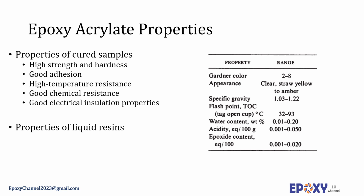In terms of shrinkage, upon cure, the volumetric shrinkage of vinyl ester resin is generally lower than that of unsaturated polyester resins, but higher than that of their parent epoxy resins. The volumetric shrinkage increases with increased backbone, double bond, and co-reactant content. Because of their high shrinkage values compared to epoxy resins, vinyl ester resins exhibit only moderate adhesive strengths.